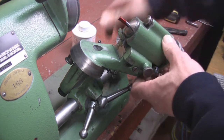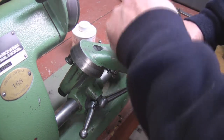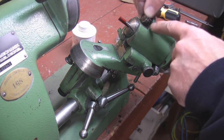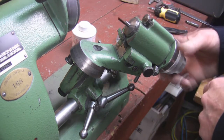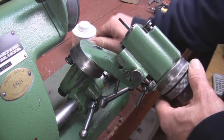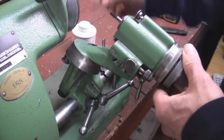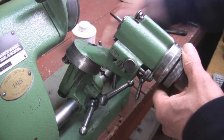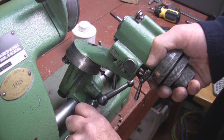So now that we've got this set, now we're going to pull our pin out and put it in the left hole here. Now, I hope this makes sense to you. What we're going to end up doing here is grinding our relief. Now you can see I'm nowhere close to this wheel. So this is where I talked about in the earlier videos how sometimes we need to loosen things up a little bit. So I'm going to loosen this lever down here,